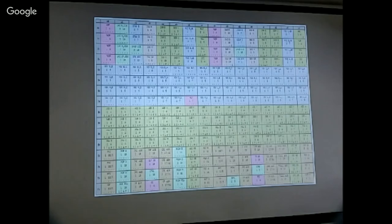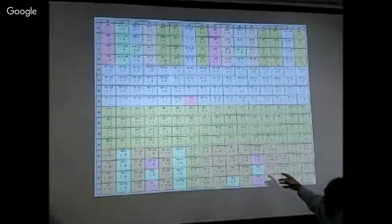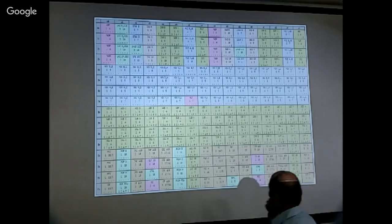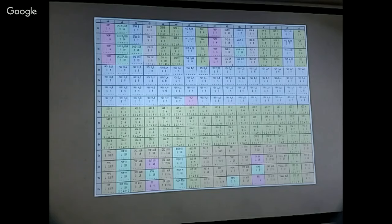Okay. And then the bottom block is mostly the jump instructions: jump, call, return, with some other things related to the call. You have push and pop separated out as individual instructions, but these are mostly required for subroutine threading. So they have this block implementing these related instructions. And the top block is the miscellaneous things that you have to do in addition to the other things. So basically, it's pretty filled up.